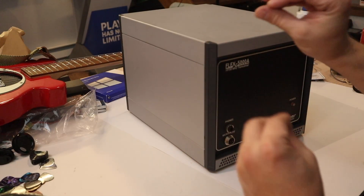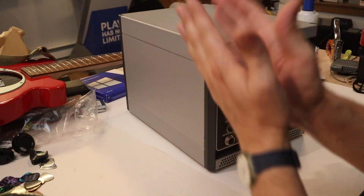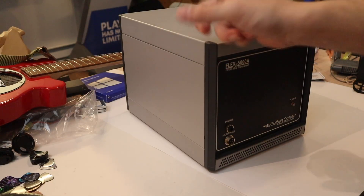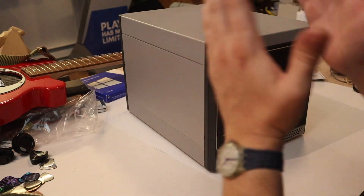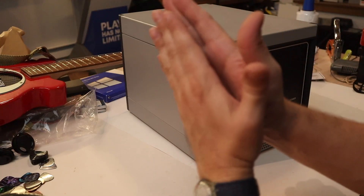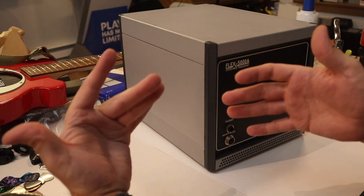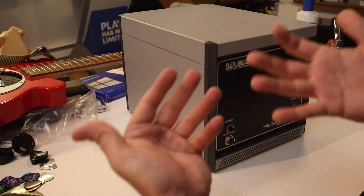Where normally you'd have discrete components and run it through a different filtering circuit to weed out everything else and just let you listen to one frequency — when I say frequencies, just like your FM dial, you're pushing buttons to pick up a frequency. Imagine that your radio, instead of moving to where it was with its little window, has this massive window and can pull it all in at once, and then let a computer pick and choose which parts to dial into. So you're actually receiving all of it.